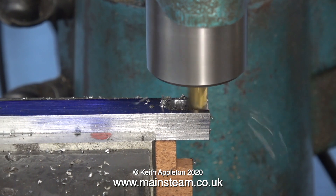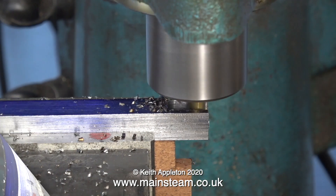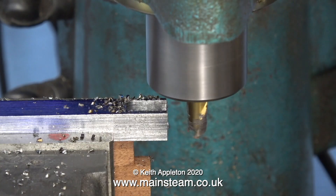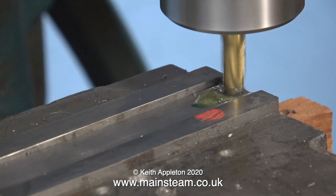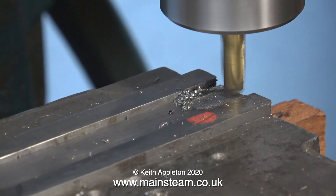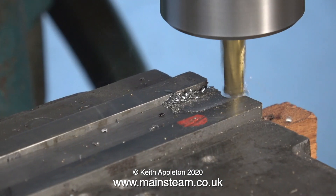My milling machine is not a particularly expensive unit, but the parts are generally very good, although I can still make a mess when using it. This clip was taken from part 28 and shows me doing a test machining of a piece of steel bar using a slot drill which is three-eighths of an inch in diameter — the finished size I need the slot to be — but it didn't work out, mainly due to the piece of metal not being supported properly in the machine vice and sticking out too far. So in this episode, using the piece of steel I cut off the main one-foot length, I'm showing how I'm going to do this job.